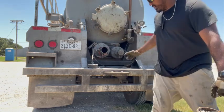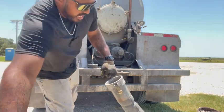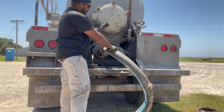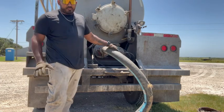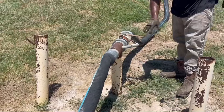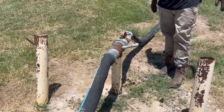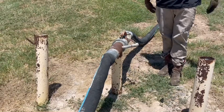We're going to get the hose and hook it up. It has these ears on it — these are called cam locks. We're going to put these ears and close them. Close those cam lock ears. Now we are officially hooked up with our four-inch. There's suction in the tank, so now we're going to open it up.